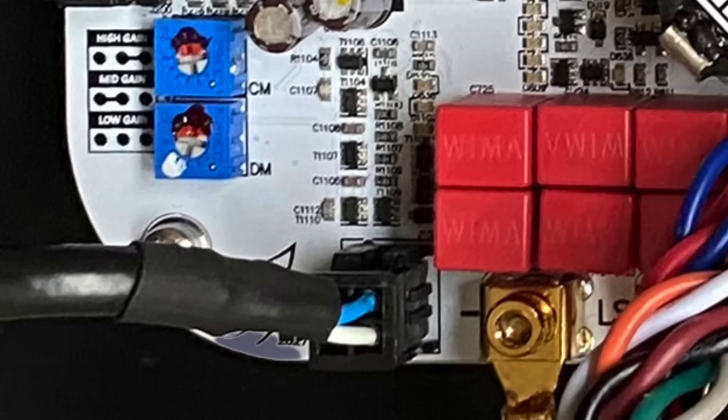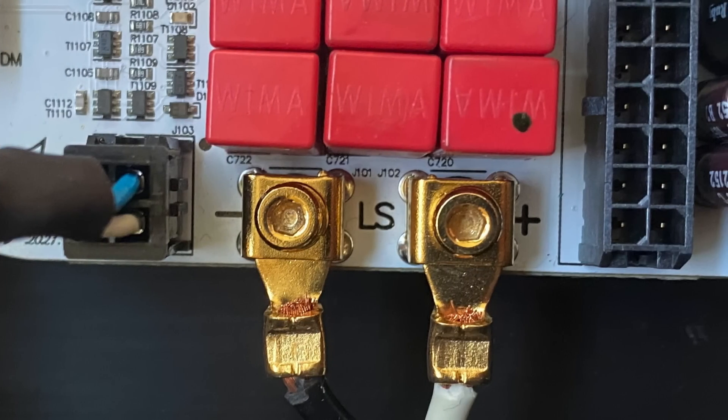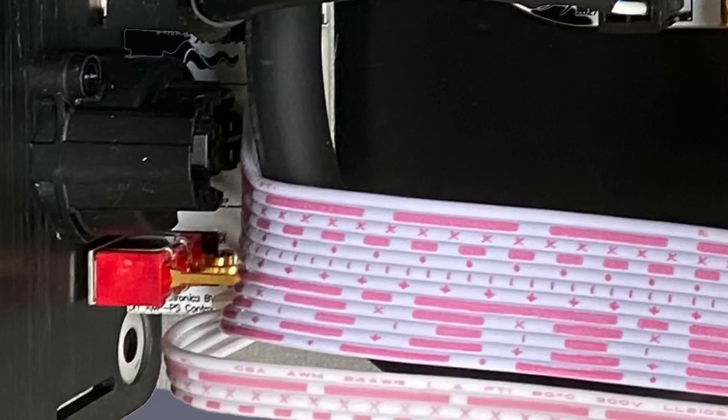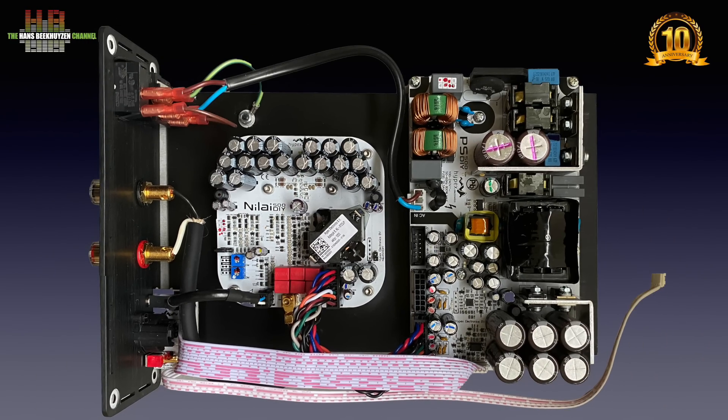The wiring to the loudspeaker terminals is found here. Remove the power leads and these terminals can be seen more clearly. Below these band cables there is a small circuit board that holds the input XLR, the trigger input and the switch for the LED brightness. The cable from the power supply delivers the signal for the standby mode, the LED on the front, the trigger input and the standby push button. The smaller band cable goes to the small circuit board on the rear of the front plate, which holds the LED and push button.